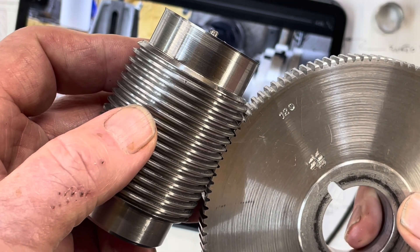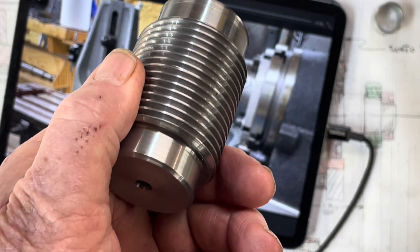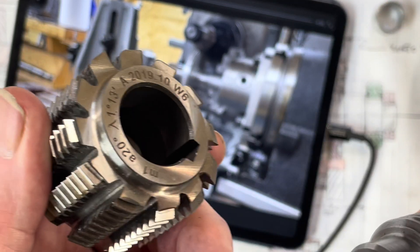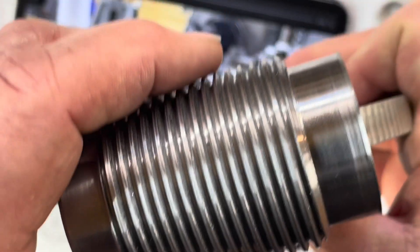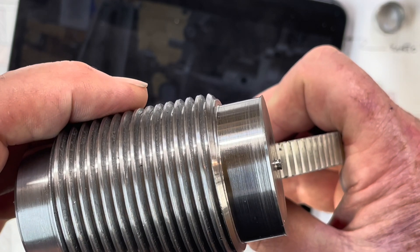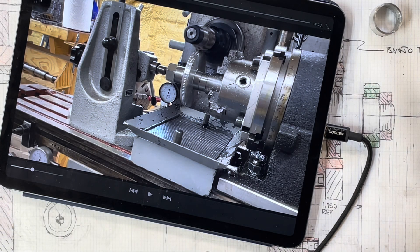This worm is probably going to see about 20 revolutions, so it's not very much. If you're wondering why it's so big, it's because I wanted to match the helix angle for the hob - this is basically the same diameter as the hob, that's the only reason it has to be that big. If I had a smaller hob I could have made a smaller worm. But because of the way I cut it, taking the lead correction out, you can see this lines up very nicely in hard mesh, right along the sides of the gear.